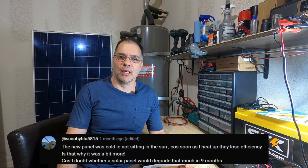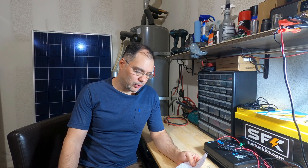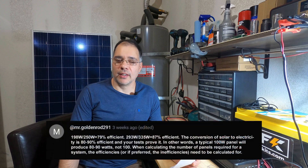So one mistake was that the two panels I tested — identical panels — one was in the shade and one was not, so the output was slightly higher than it should have been because the panel didn't have time to heat up. The other mistake was that the meter is sometimes not accurate. I said the current was actually higher than the short circuit current, which really shouldn't ever happen. And the third mistake was the calculation — how to calculate the rated power versus the real or actual power. We'll cover those in the video.